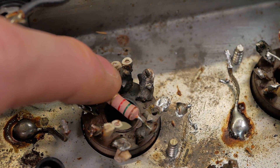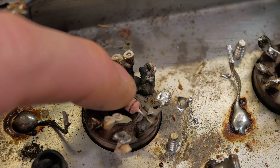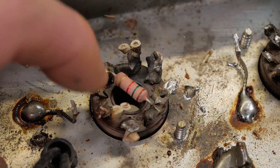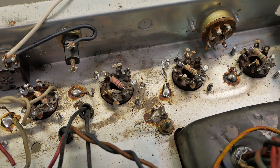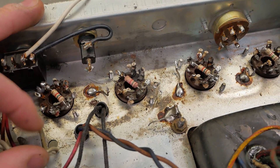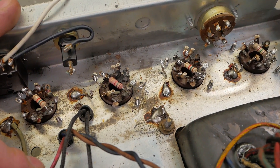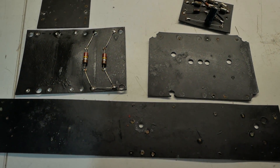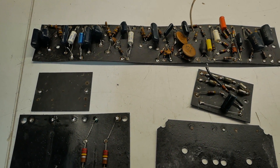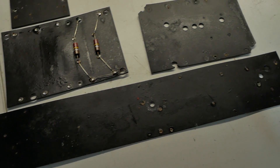It gets to such a high voltage that it arcs to the next pin, and the closest thing near ground potential is the heater wires. Once that's happened, it can be tracking through the actual plastic itself. I've seen people try to dig it away and it still keeps occurring - just change the socket. Since I'm not happy with the sockets anyway, we'll change the lot and put some sturdy, tightly-gripping Beltons in their place. We'll fully depopulate all boards, clean off all the wax and dirt, and get all the moisture out - I might even bake them overnight at around 80 degrees.